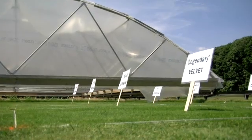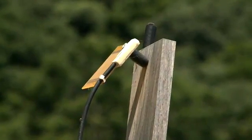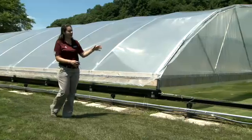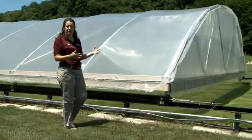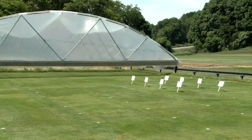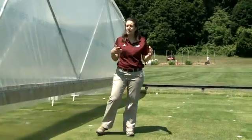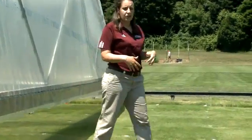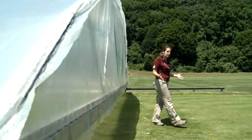As you can see now, we're simulating a natural rainfall event. We put some water on the back sensor and it's closing the rainout shelter, going over our plot area. What we're trying to do is minimize the amount of rainfall so that we can simulate natural drought-type conditions. Once it reopens back up under normal conditions, we'll come back and irrigate — keeping some areas under well-watered conditions and some under complete dry-down.